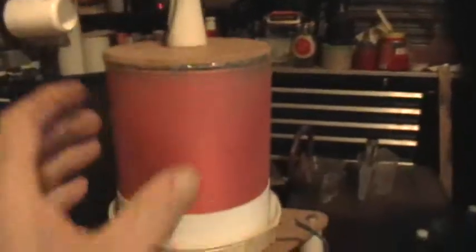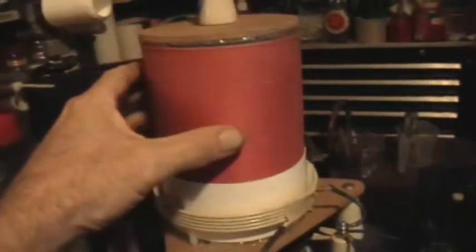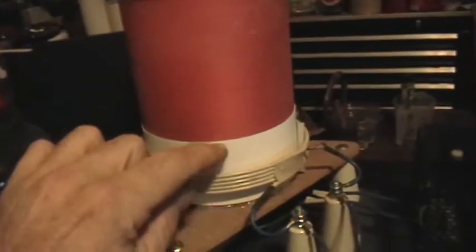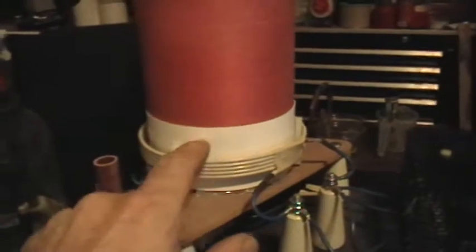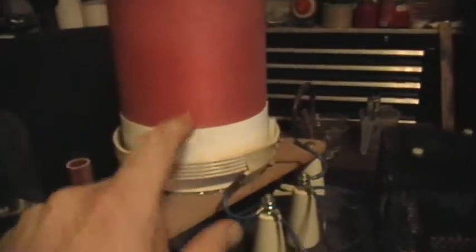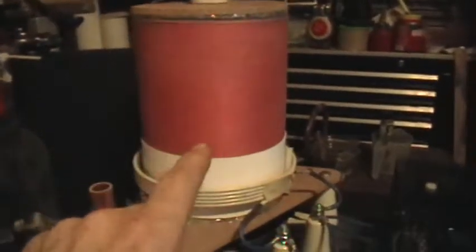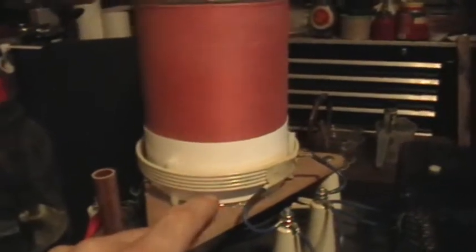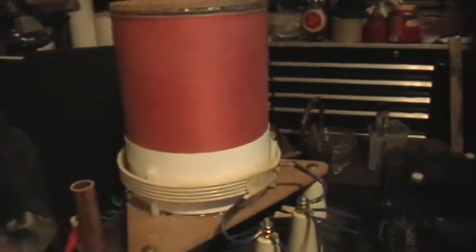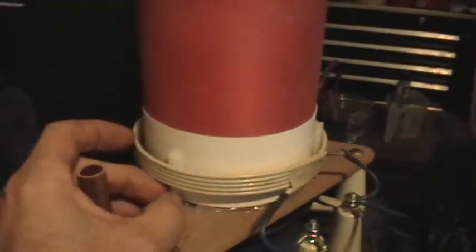Here's the resonator. This is a piece of PVC pipe — I used black pipe, though I probably should have used white pipe since the black pipe might be conductive. This white part here is just a little plastic insulator — one of those cutting sheets from a kitchen supply store. There are 420 turns of No. 27 magnet wire on that, sprayed with clear Krylon to coat and insulate it. Then there are 5 turns of No. 12 house wiring, offset by a quarter inch all the way around using little plastic spacers.